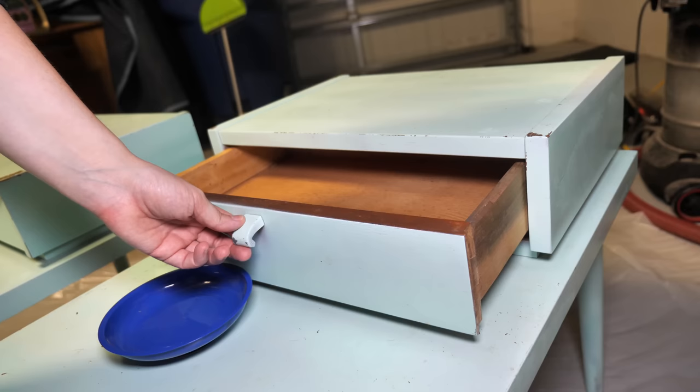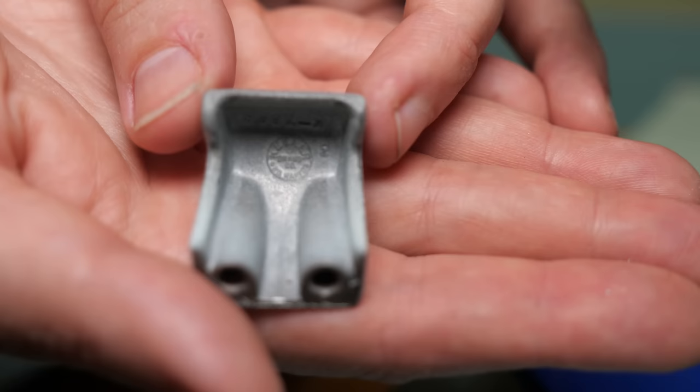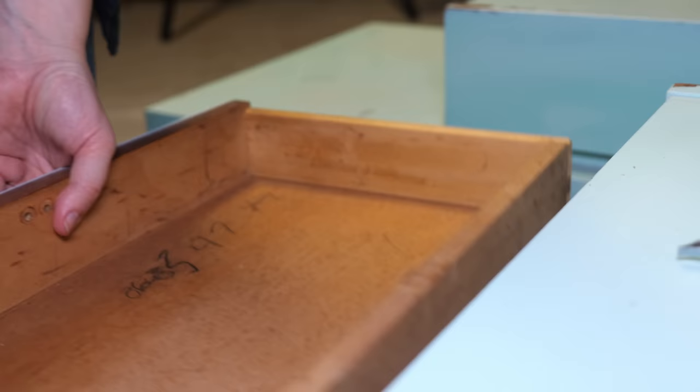These tables are very simple in their design, and the flat edges make it a bit easier to restore. Based off my research of this set online, I know that there are different directional veneers on this piece, so I'm going to start off by stripping instead of using a paint scraper. I don't want to risk gouging the veneer or tearing the wood grain.